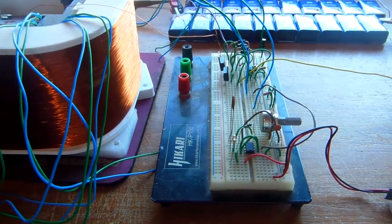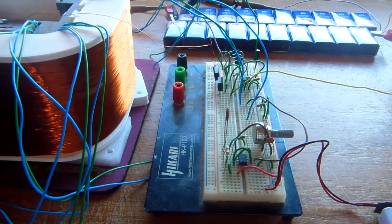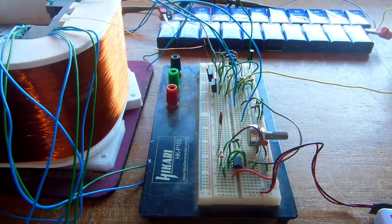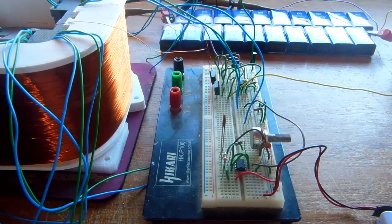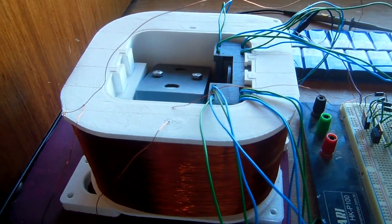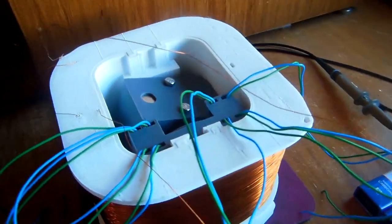I decided to stop using Arduino and reed relays because they have shown to be unreliable for this project so far. I created a simple circuit using 555, MOSFETs and Zener diodes that have proved to be much more resilient to high voltage and electromagnetic interference. This is my last iteration that has some design improvements as well.